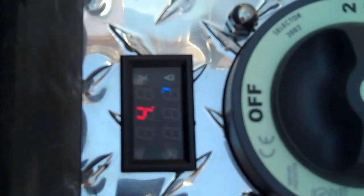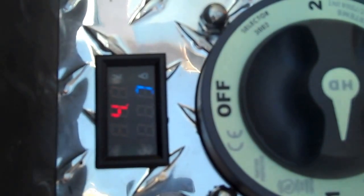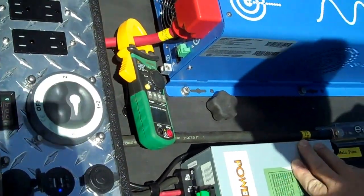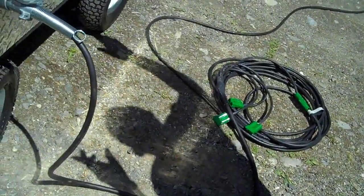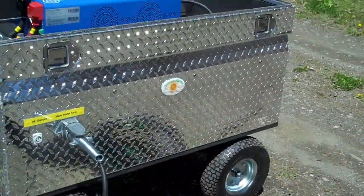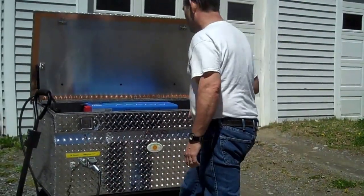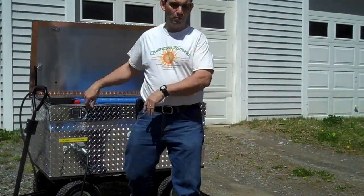On the actual screen it shows 24.9 — that's the voltage. The blue is the amperage: right now 7.6 amps. This solar panel is set up for 36 volts on a 24 volt system, so it's putting seven to seven and a half amps at 24 volts. As you can see from the combiner cable, this system will handle additional solar panels. This exact model will actually handle five of those solar panels. One panel is probably a minimum — you'd probably want more. You can also use larger panels; it's flexible. You can use whatever panels you want as long as they're 24 volts or greater. So now we've got something else running in the house, and as you can see, this system has no problem running whatever comes on.